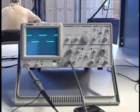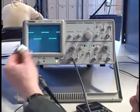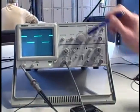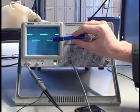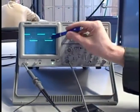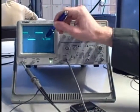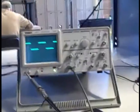But once again, we'll take a look at the vertical and verify we're reading properly in vertical. We've seen how that works with the 9-volt battery. Now I want to check our square wave source. Currently we are on 1 volt per division. Looking vertically, here's my center line. I'm going to go 1 division, 2 divisions. So it looks like I have 2 divisions. Each one of those is worth 1 volt. So sure enough, this is a 2 volt peak-to-peak waveform. From one peak to the other peak is 2 full volts. All right?